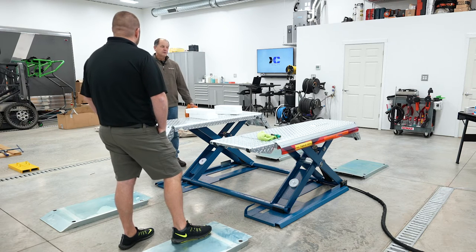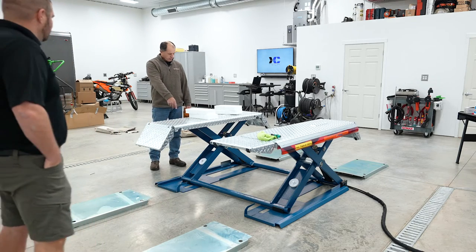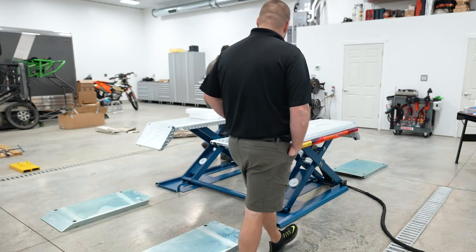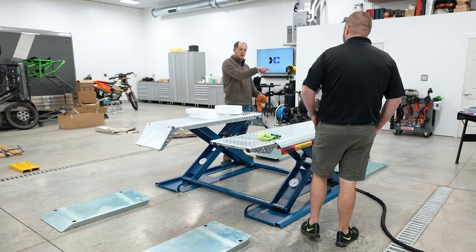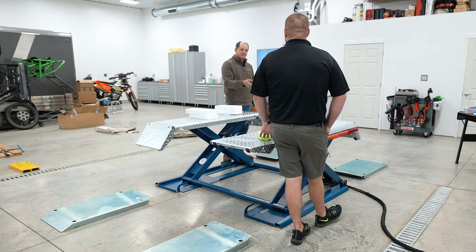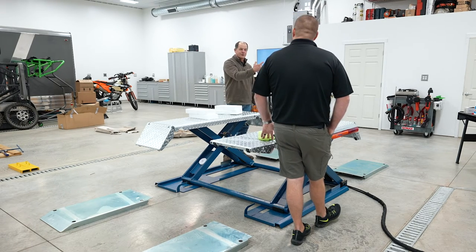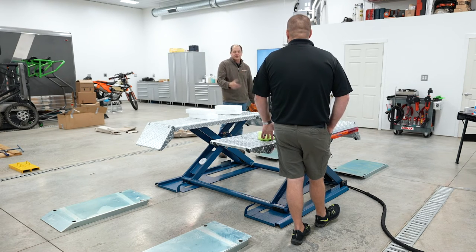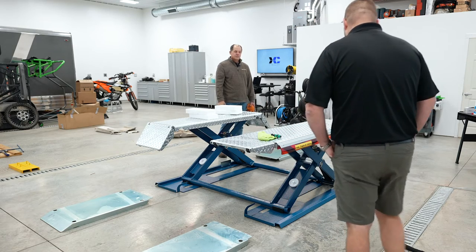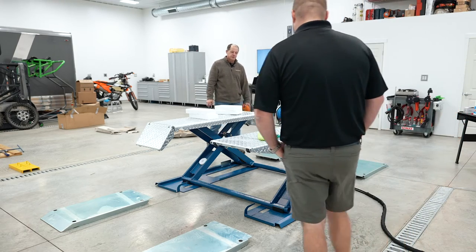Yeah, if you dump that fluid out of there in 5 years and put new fluid in, the trick to doing that is to put your brakes in there. Take that hose off of that cylinder and put it in a bucket, and hit the up button. Just flush it out until it doesn't push any fluid out anymore, and then hook your hose back up and put a whole new thing of oil in it. That'll empty it out with an inch or so left in the bottom of the reservoir, and that'll get you enough of a changeover. Other than that, you're turning that thing over and having two guys trying to hold it while you dump it and not spill it, trying to dump that whole reservoir.